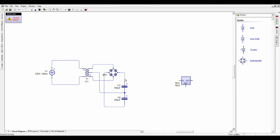So, yeah, about 20 volts and minus 20 volts. That should be fine. So we take our 7815, and we'll take the 7915 as well. Oops, 7815. Now, linear regulators like this aren't the best. They'll get very hot if you draw more than an amp from them. Well, actually, if you draw at least 500 milliamps, they start to get warm.